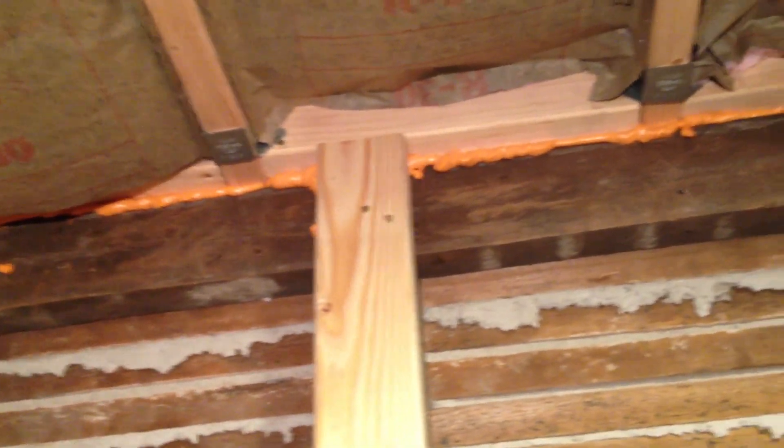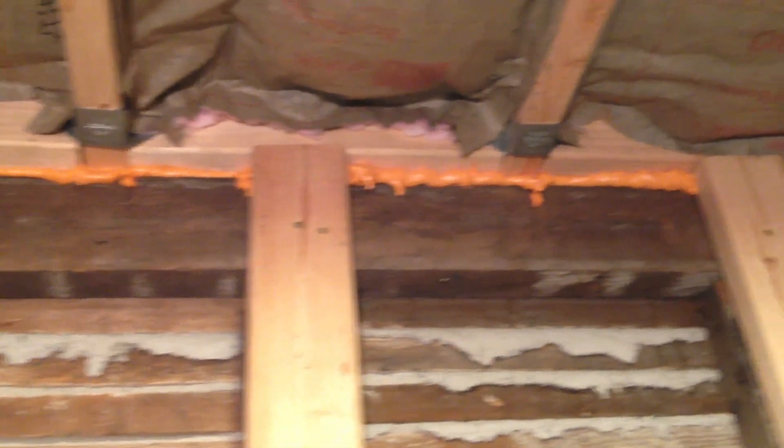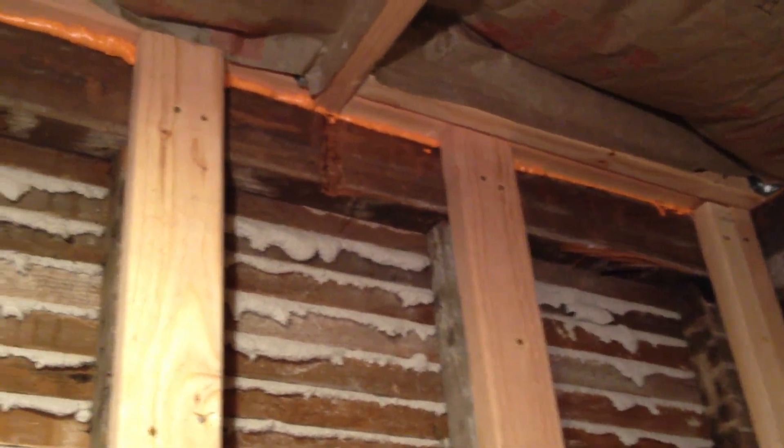As you can see, a lot of this spray foam is now installed and it's pretty much everywhere along the top and along a lot of the bottom. On this job it made sense to use the spray foam because there were a lot of small cracks. When you have a lot of small cracks like that, it just makes it much easier — you spill the foam in, spray it in there, and it expands.